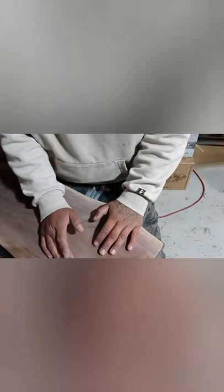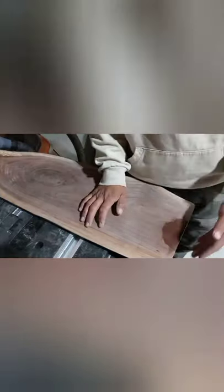So I'm going to literally give that probably about 15 seconds. So if I see there, and look at that. Well, this is just the activator moving, but that is dry. Like the glue is dry. Now with epoxy, you could get a fast curing epoxy that takes 6 hours. Or you could get just a regular tabletop epoxy, what we use for this, that takes 24 hours. Or you can use CA glue, and that takes 12 to 15 seconds. You see how fast that was? Boom. Done. And it's dry.